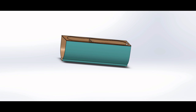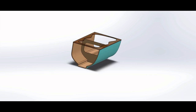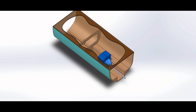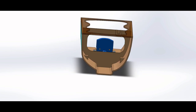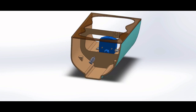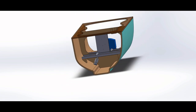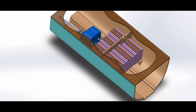I made 3D CAD of our project so we could see how the different components fit and make drawings to work from. We started by taking measurements of the hull — drawing boats in SolidWorks is definitely above my skill level — then we sketched in the shaft. I made a drawing of the Ocean Bolt AXC motor based on the datasheet specs. I knew we'd need to add blocks to the inside of the hull to support the batteries, so I sketched those in, then added the heat exchanger that will replace an existing through-hole — a bronze plate on the underside of the hull plumbed to the motors for cooling. Then I drew in the structural pieces that will support the batteries, and finally placed the batteries themselves: 56 Nissan Leaf batteries stacked in and squeezed against the bulkhead just forward of the motor.